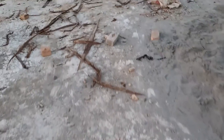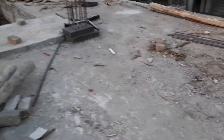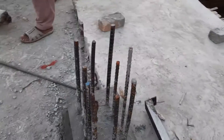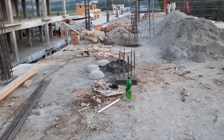The only mistake we have here is the lapping. As for the starter, they already did the concrete to provide the formwork properly for this column. The lapping is not sufficient for this RCC column. Hope this short video can help you — thank you.